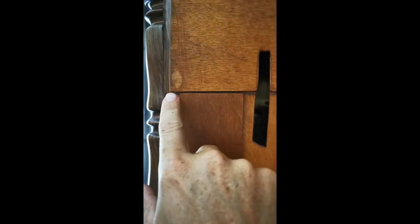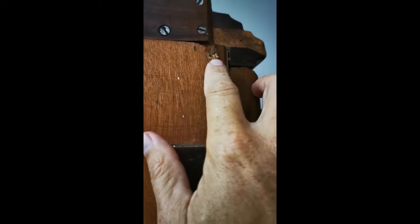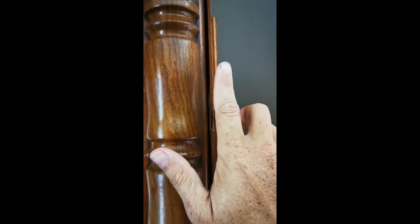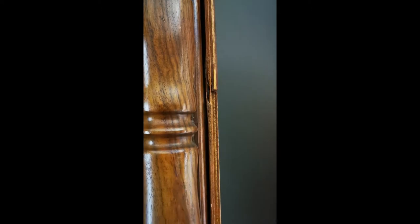Welcome guys. Let's see. The first thing that I've noticed on this clock is that the screws that I use to keep the head of the clock to the back plate have been tearing out of this wood. Now, my grandfather built this clock in the very late 80s, early 90s, and he gave it to me. So this is real wood, it's not any imitation wood. This clock is extremely heavy, but he used this very simple layered wood here at the back to keep the back of the clock connected. So I'm going to have to use washers to fix this problem.